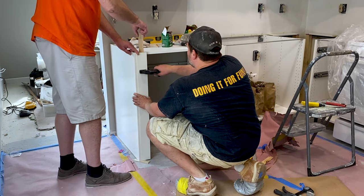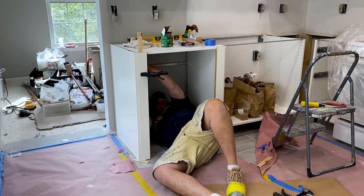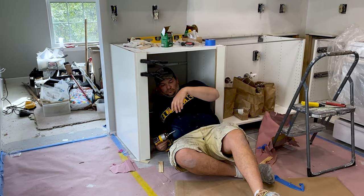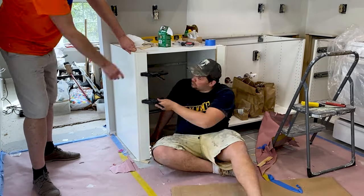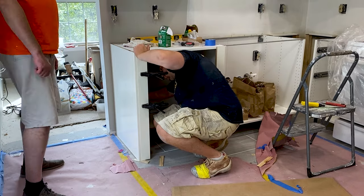With the height set by the shim, we repeated the same steps on the left side — attaching clamps and securing the trim pieces with one-and-a-half-inch screws from the inside. You have to be very careful in this step not to put the screws through the trim piece. With the support strip and screw both being one and a half inches, you have to slightly recess the screw to secure the trim piece without damaging the front of it.